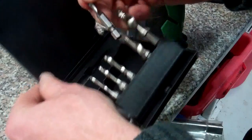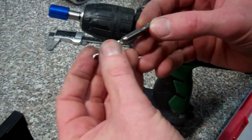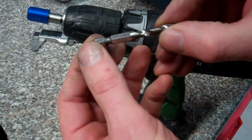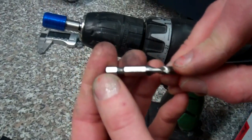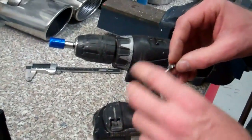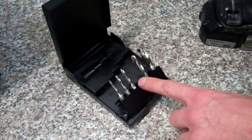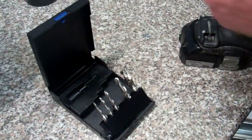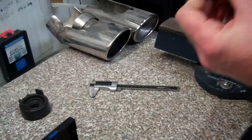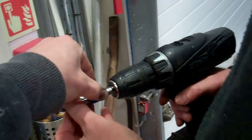How's it labeled? The sizes are labeled on the bits themselves — it'd be handy if they did it on the holder too. So on there you can see M6. They start off with M3, M4, M5, M6, and then it jumps to M8 and M10. Obviously the M10 you're going to have to use in thinner material or softer material — you'd be pushing your luck otherwise. Let's clip it in and pull that back.